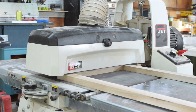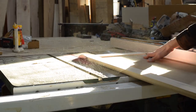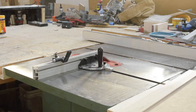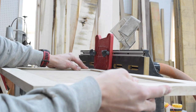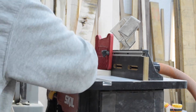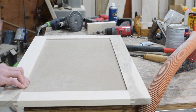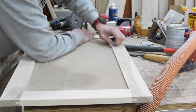Just to ensure that all my doors and rails and stiles are flat and consistent thickness all the way through, I run everything through the drum sander. That flattens the doors, gets rid of the highs and the low spots, and ensures the doors are going to be consistent all the way across. After flattening everything, I square everything up using a cool little in-feed table which allows me to square up the larger panels. Then back to the door — a 1/16th roundover bit on all the edges just to ease those edges and help the paint, because a rounded edge holds paint better than a sharp corner.